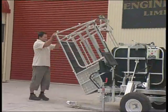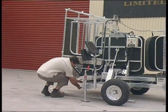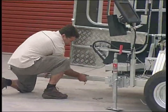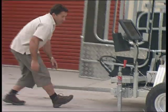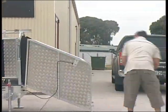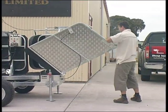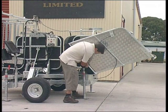The machine is fully transportable. To transport it safely, follow the steps shown in this video. Remember to check carefully that the drawbar pin is in securely, and also check for any wear and tear in this area before towing each time. Due to the drawbar being removable, this can become a weak point over time if towed a lot.